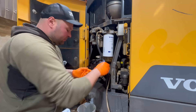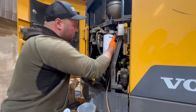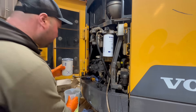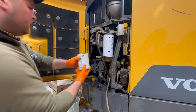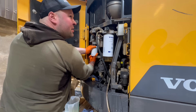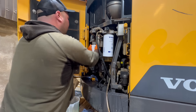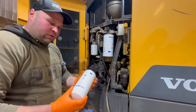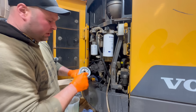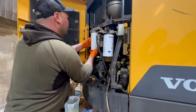We don't have to do track motors or change hydraulic fluid on this one — this is quite a straightforward service to be fair. Nearly there. Don't have to fill them right up because the priming will do the rest. There we are — that just screws on. I always put a bit on the seal just to make it slip a bit better when it goes on. And that engine oil filter — just put a bit around that seal there to make it slip and it goes on.